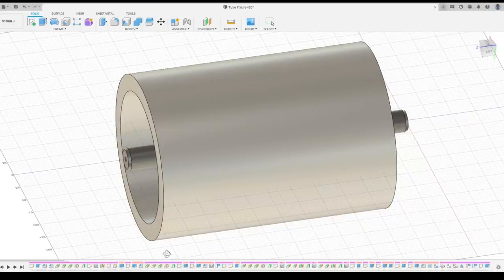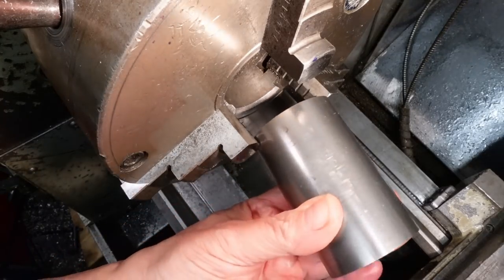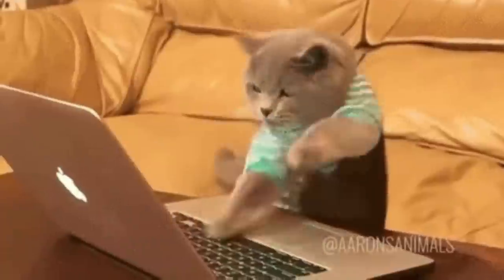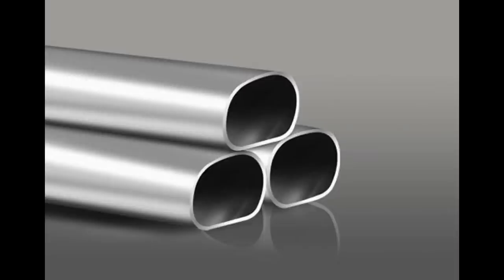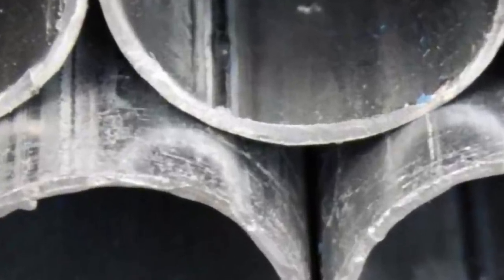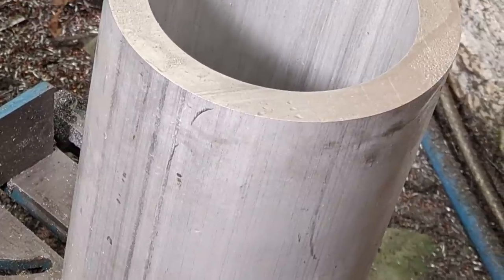I dug around in my metal store and found a bit of 25mm cold rolled steel and some 65mm leaded EN1A plus some 17mm hex mystery metal and a bar end of 30mm brass, so started messing about in Fusion 360. The rough spec was to make the thing modular and adjustable, so I could use it to mount tubular workpieces which had a somewhat circular cross-section, with swappable soft jaws that could be machined to an exact fit on precision tubes, or jaws with teeth that could grab circular hollow section with weld seams or not very round extrusions. This big tube is sort of round, but only within a millimetre or so. That ruled out precision soft jaws.